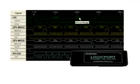Better logic analyzers will do some type of analysis on the data. You'll be able to set a type of interpreter on the data — display it as hex, say this is an address. You can group together 16 different clips on your address bus and see what addresses are going across the wire. You can also look at data going across, and you can have interpreters shown on the left-hand side. For example, look at the bottom — it'll decode RS-232 for us. We see the commands coming across; we don't have to look at bits anymore, and that's how it should be.